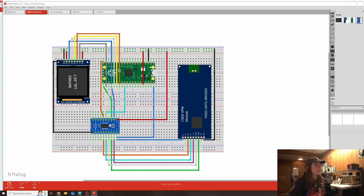The level shifter gives us 5-volt logic on one side and 3.3-volt logic on the other. The display setup is basically SPI even though they used I2C labels - SCL and SDA are actually a clock and MOSI pin. There's no MISO here since the display doesn't respond with anything, it only receives. Pin 1 is here, pin 40 is the USB voltage, so we're powered off the USB connection. USB is just for power - we're not doing any serial, though you can turn on serial for debug.